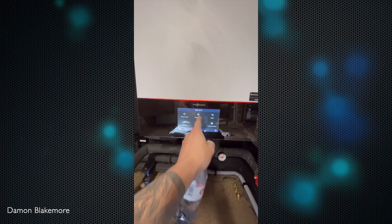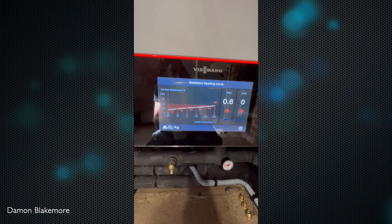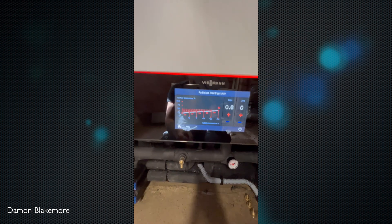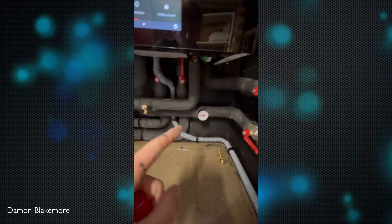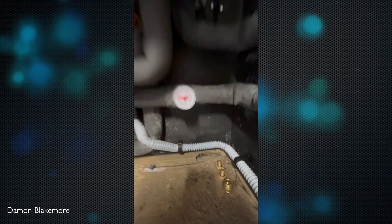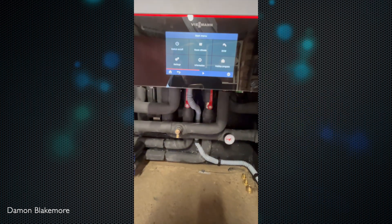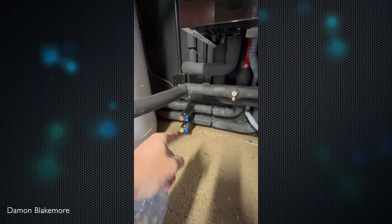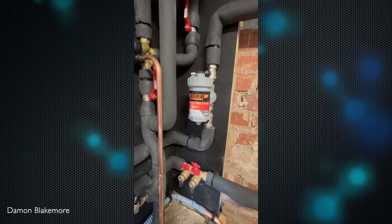You can see the current weather curve which is at 0.6 — I've dropped it a little bit below and we'll knock it up if they're cold, but it might be all right there. There's a pressure gauge down there, isolations for heating, isolations for the heat pump itself, and fill and flush points — buffer fill and loop fill and flush valve for heating, and a magnet strainer.